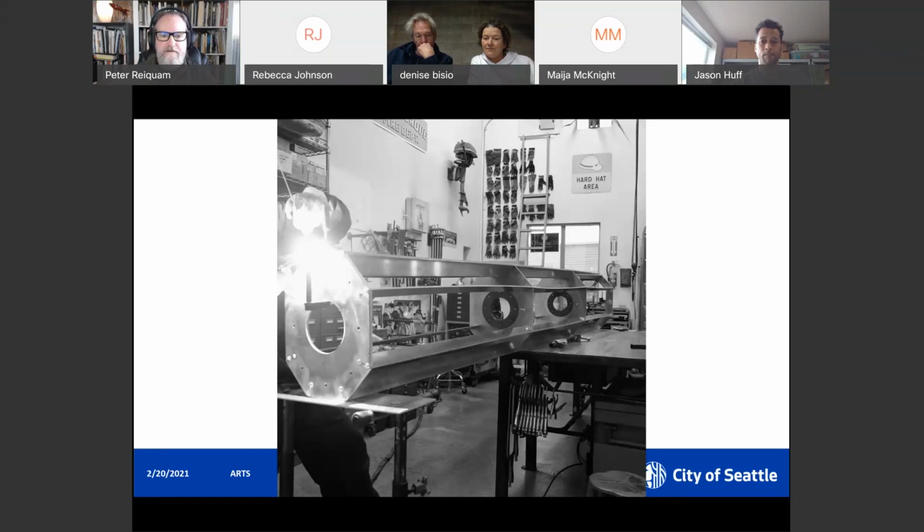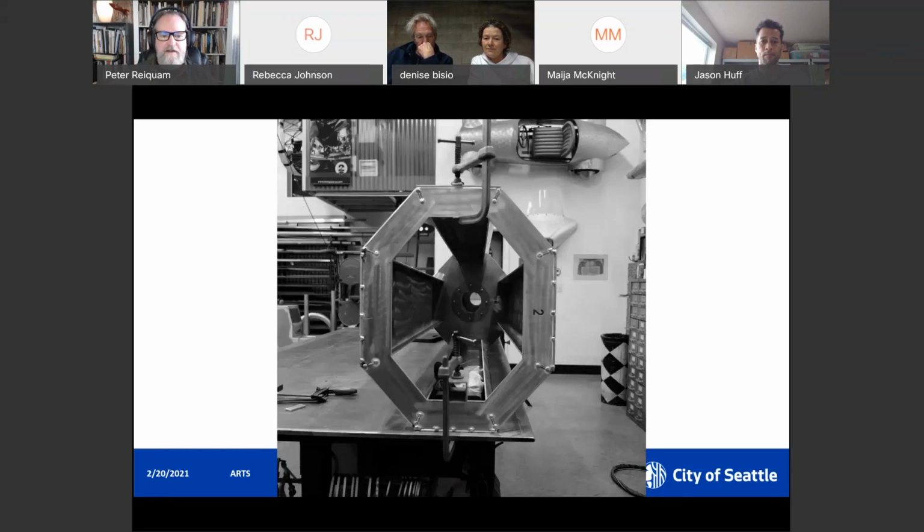Next slide, please. But if that powder coated finish gets damaged, if it gets scratched and exposes bare metal, the aluminum isn't going to bleed brown rust out of that scratch, but a steel piece would, and that rust stain will coat the surface of the piece and bleed down onto the footing or the plaza or wherever the piece happens to be sitting and leave a really unsightly stain. So using aluminum eliminates that.